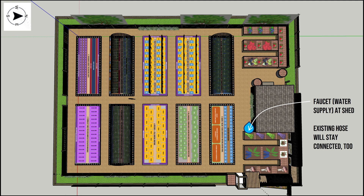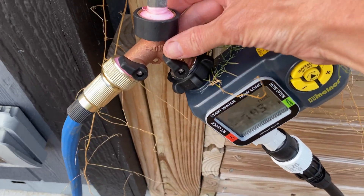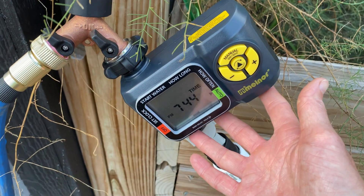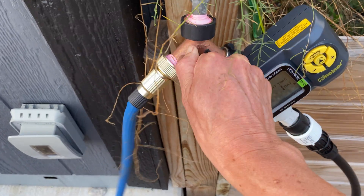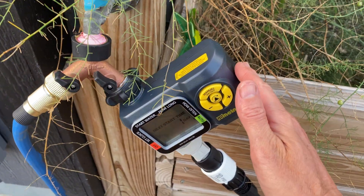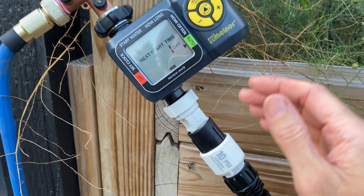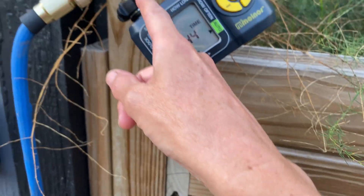My faucet is located at the southwest corner of my garden shed. Let me walk through the faucet connections and parts needed when branching off the water supply. I attached a brass Y to the faucet — it has built-in shutoff valves, so I can leave one side open permanently going to the automatic water timer, and keep the other closed for the hose. Part three is a backflow preventer, which stops anything from these lines getting back into the water supply — important, and in many jurisdictions legally required.